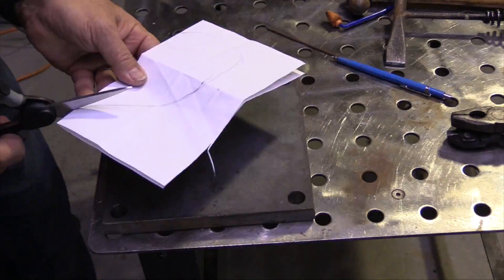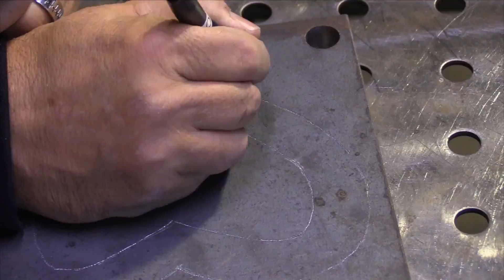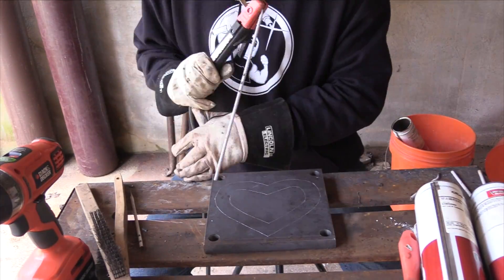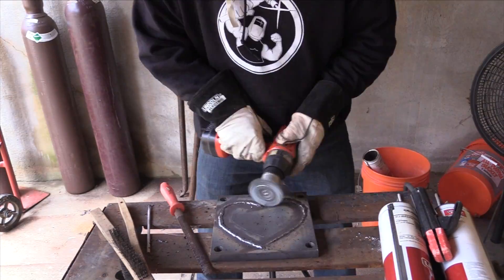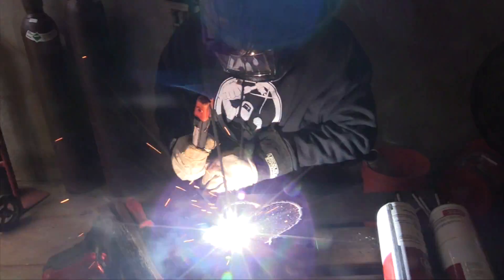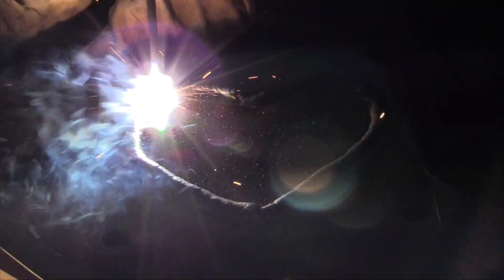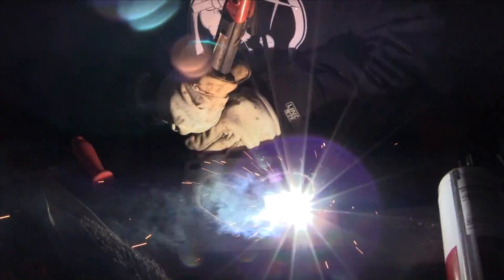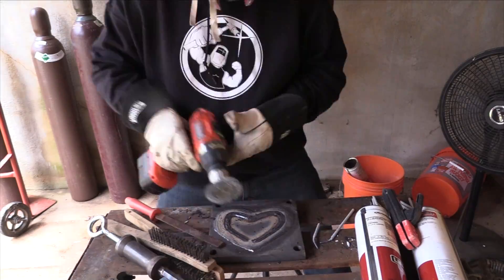Let's have a little fun now and put together that heart. Using a little paper doll trick here — tracing with silver pencil an inside and an outside, then making that a little more easy to follow with an air vibro tool. I started off with 125 amps, which was plenty hot for that quarter inch thick stuff, but this is closer to an inch thick, so I had to bump up to 135 amps. After a bead or two it was just about right once things got preheated. I'm brushing every bead, making sure to knock off any spatter, using a wire wheel and a cordless drill to knock off slag. I'm just going to weld a bead or two more, shine it up, and call it good for the day.